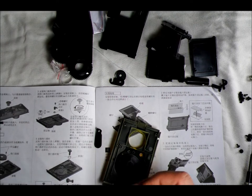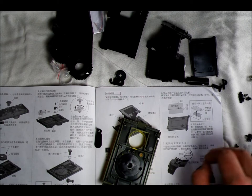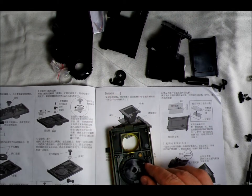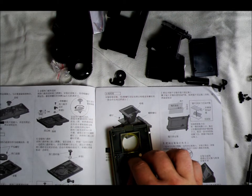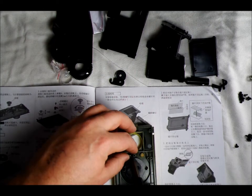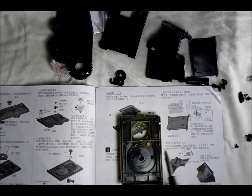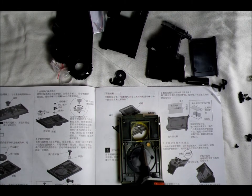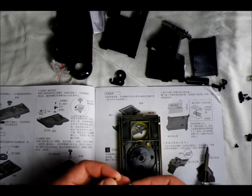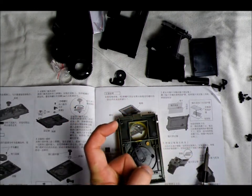Spring B is the very, very tiny spring — this is about the hardest part of the assembly for this step. You also need a flanged screw. There are a couple of holes up here: one on the left and one on the right, a grouping of two right above this plastic plate. The shutter blade gets screwed into the one on the left, with the hook oriented like this.